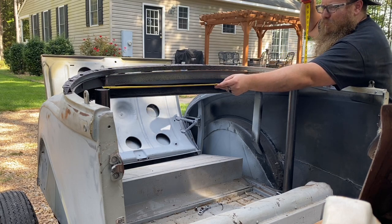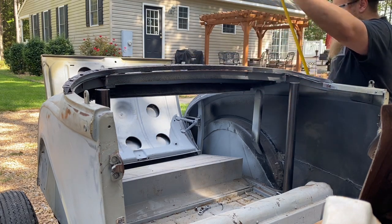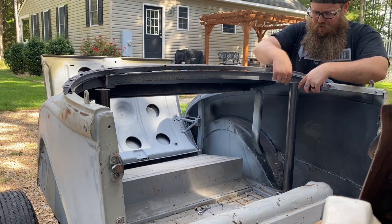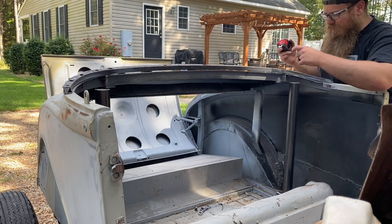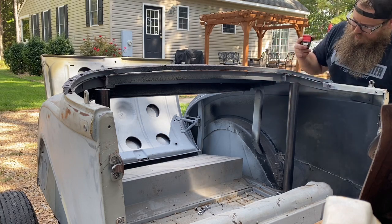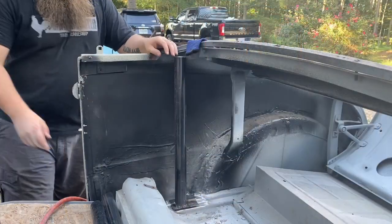Guys make this part too complicated. And that's about 39 3/4. So I'm gonna cut my other pipe at 39 3/4. Then I'm gonna cut a V on both ends. And that V will slide down inside here, and I'll weld up that V. Super simple. I don't need any fancy pipe cutter or hole cutters to cut around the ends. Trying to make this stuff not as complicated, guys.